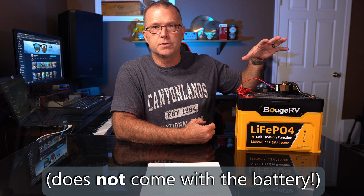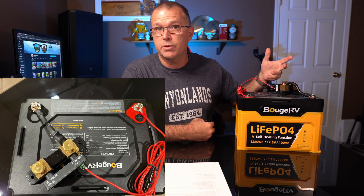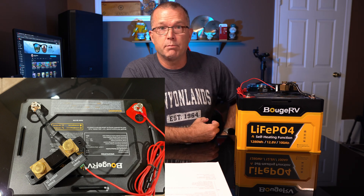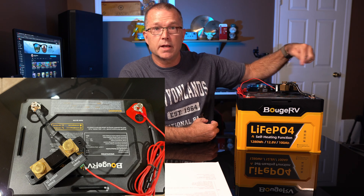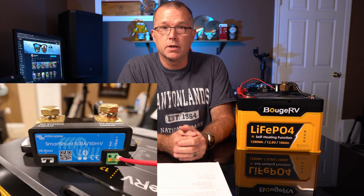This thing on top is the Victron Smart Shunt. It's got a lead that comes off onto the positive pole of the battery that powers the Bluetooth module and you connect with an app. It allows you to monitor your battery or your battery array if you have multiple batteries in a bank wired together. As long as everything coming in through the black wire is coming through the Smart Shunt, you can monitor the entire state of your battery bank. It's a very cool device — the Victron is not cheap, I bought that with my own money. We'll put a link below if you want to check it out. If you're going to get into a configuration for power storage using these kinds of batteries, highly recommend something like that.